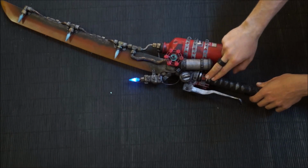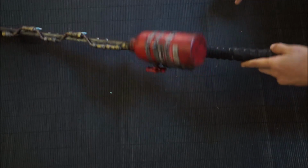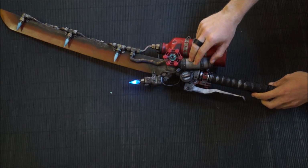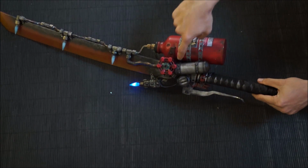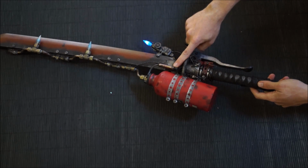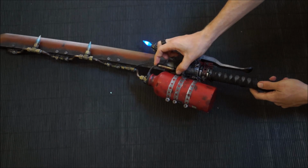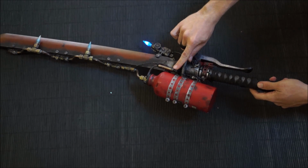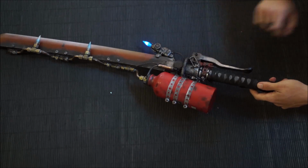The next breakout comes out of this battery, runs up into this switch right here, and then runs into this canister here. This houses a fish pump motor. This generates pressure, which actually comes out and comes in through here, but there's also a set of wires running to this, because hooked in parallel with the pump motor is this fog generation system. It's a 510 connector that I modified, and it uses modified e-cig canisters to generate the fog.